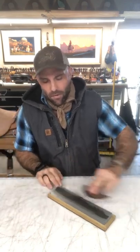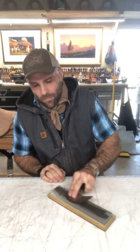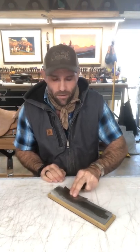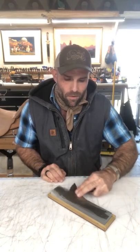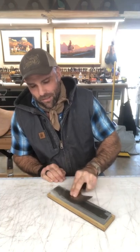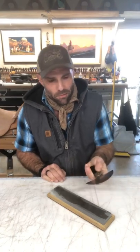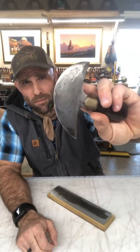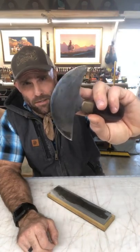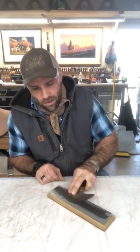I'm a fan of the circle method. You need enough pressure to abrade the material, but you don't need to go crazy — if you go crazy, you'll actually convex your edge. In this case, I'm just making these tiny little circles, working my way around, trying to keep the angle as consistent as possible. The oil is a fairly consistent distance all the way around the edge, and that's what we want. We're trying to form that little burr.